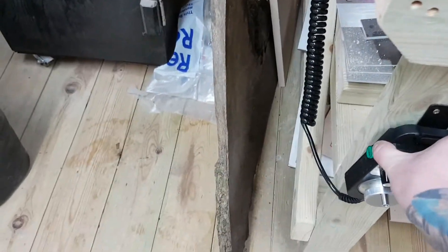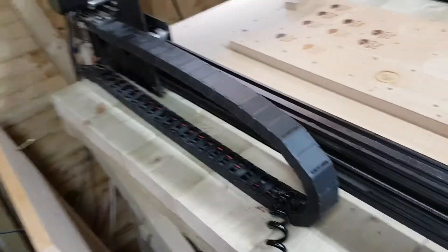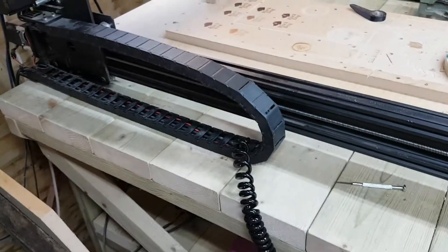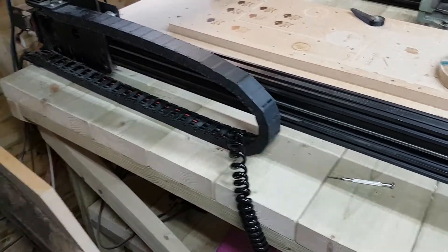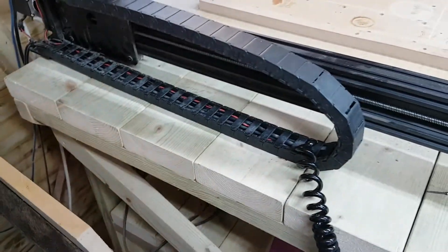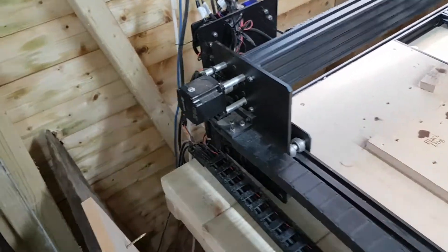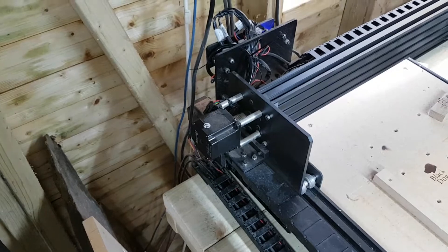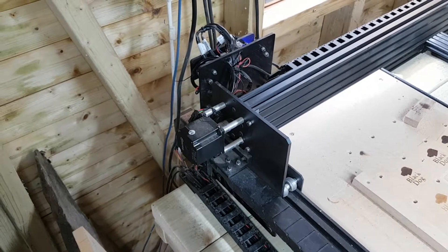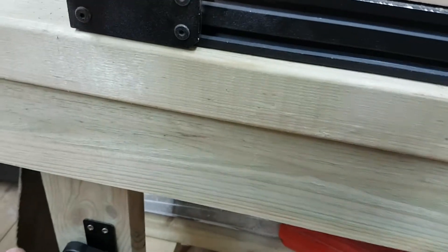I've got it on there, though I might bring the hanging hook up a bit - it's a bit low. What I changed was instead of running from the very start of the drag chain at the back, which was using too much cable, I've jumped in halfway down the drag chain. In the home position, no cable will curl back. It's also cable tied to the original cables running through there, which takes any strain off the cable and stops it getting pulled.